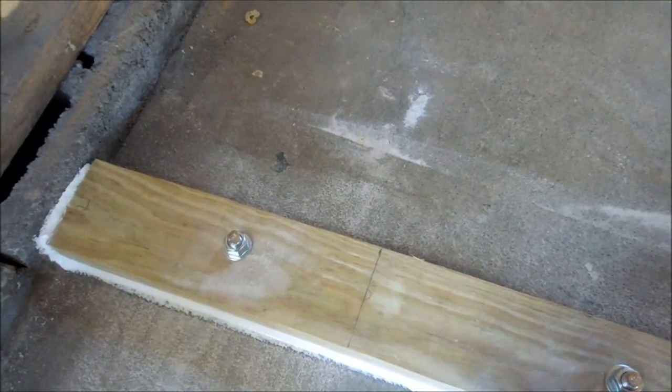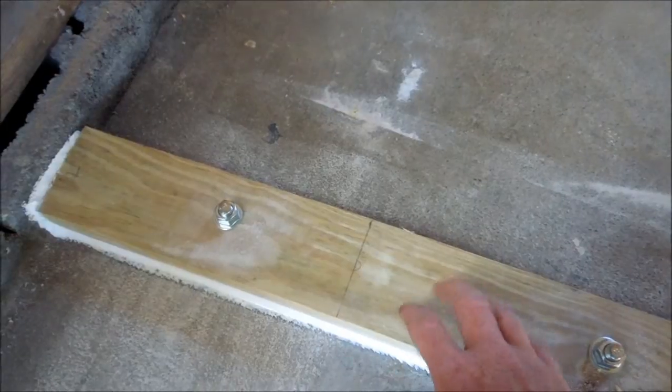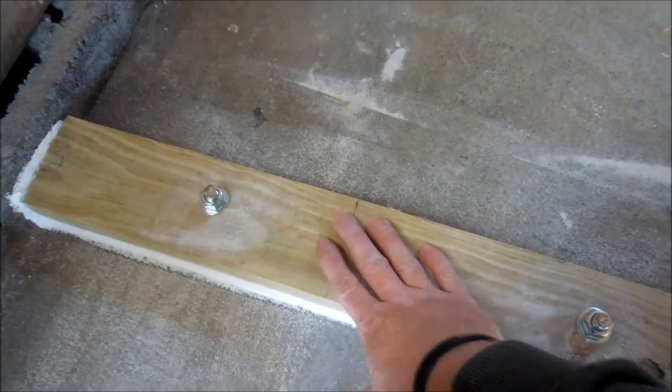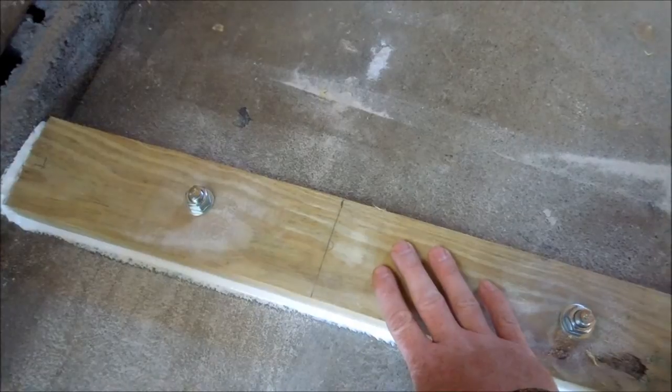If we had any water blow in from the garage door or anything, which we've had in the past, and concrete draws moisture, so it's kind of porous, and it draws moisture. So we put a pressure treated bottom plate on that protects from rot and moisture and things like that.